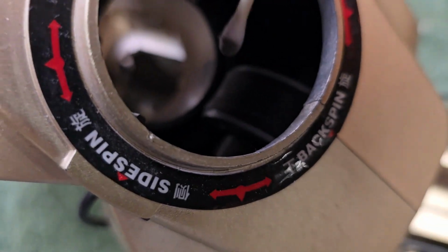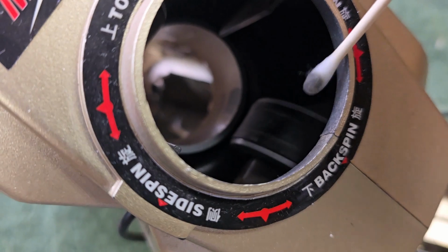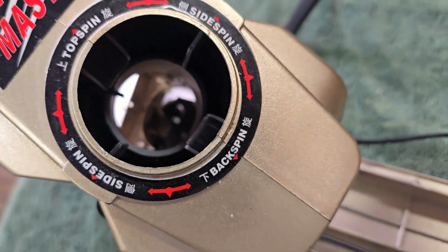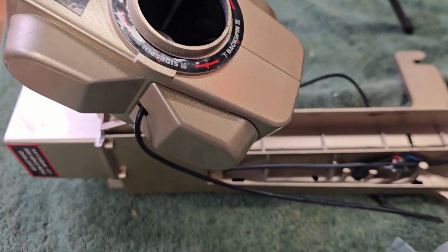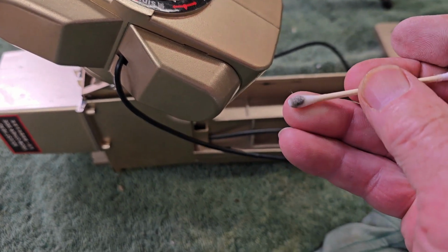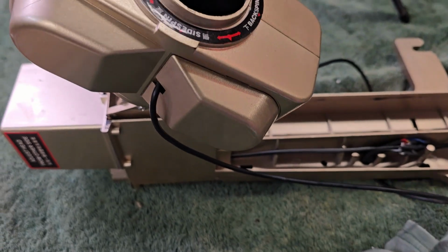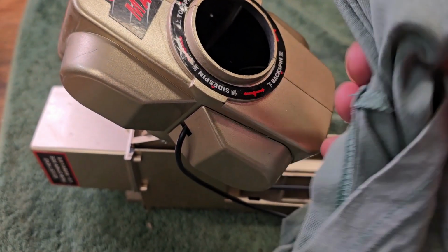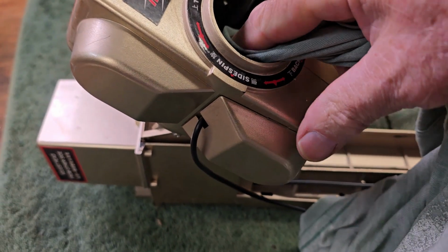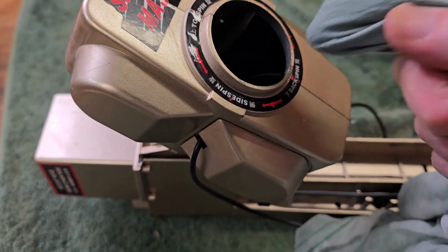So you can see if the camera's focusing okay. That's the bottom roller. The top one's identical. There's nothing else in that head. That's all there is, two drive motors. Now I wiped the rubber over with some isopropyl alcohol. Obviously it had a little bit of black grime on it, a bit of dust. So I was able to reach in with a rag soaked in IPA and spin the wheel from the other side with my other finger and just wipe the rag right around it.